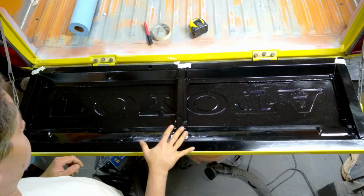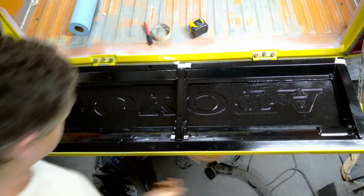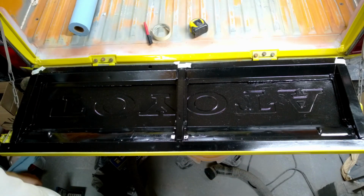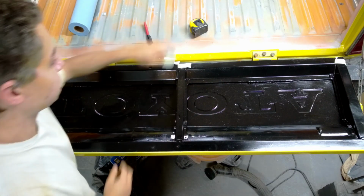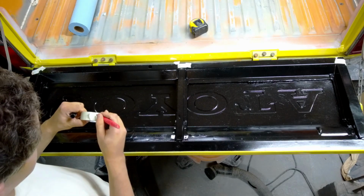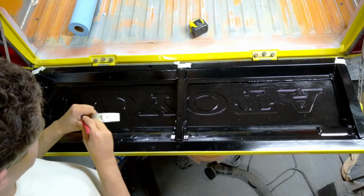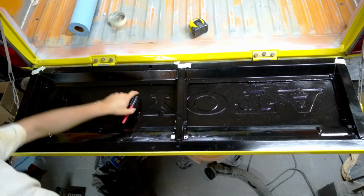I need to drill my panel to match these holes. These 3, I was able to mark from the back side really easy. But these three I don't have access to. So what I did was I took a piece of masking tape, I put a little dot on it, and I stuck it sticky side up, lined up to the hole.